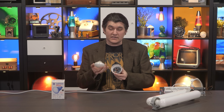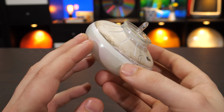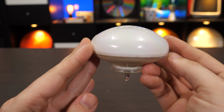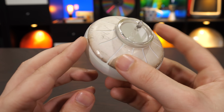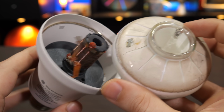But another issue with the single coil designs is that they require an even higher frequency to function, around 2.5 megahertz. And because these are operating at radio frequencies and pumping dozens of watts or more into the discharge vessel, well, radio frequency interference was a significant problem. To try and help solve it, the glass is coated with a transparent yet conductive material, such as indium tin oxide, which absorbs radio frequency energy and keeps it from escaping. And in this lamp, the underside of the discharge vessel also has a metal shield, which was bonded to this copper ribbon that allows the absorbed energy to return to the circuit ground.